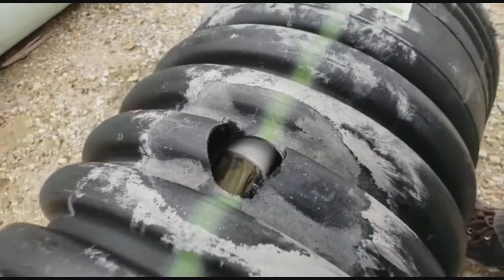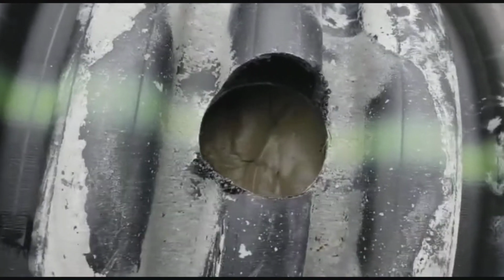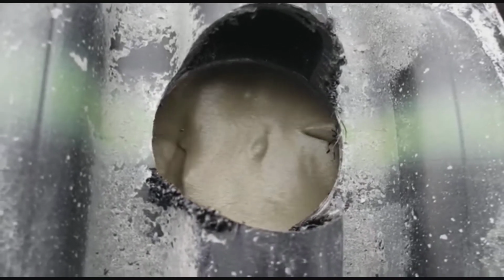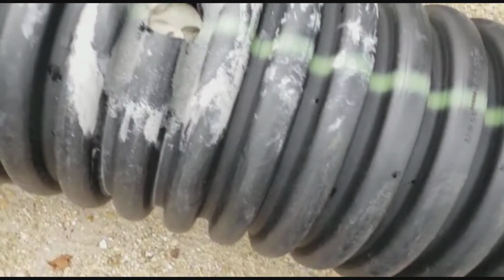Taking a look at the material flow from another angle gives a really interesting perspective on how the material flowed through the pipe. As you'll see, this also gave us another pretty good angle of the vent plug on port number 4 popping out. Even so, we did get some material to come off the vent pipe at the end, as you'd see in normal pipe abandonments.